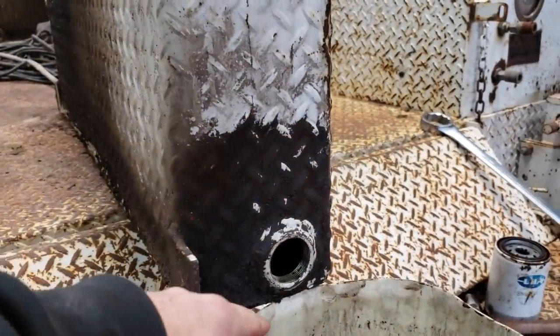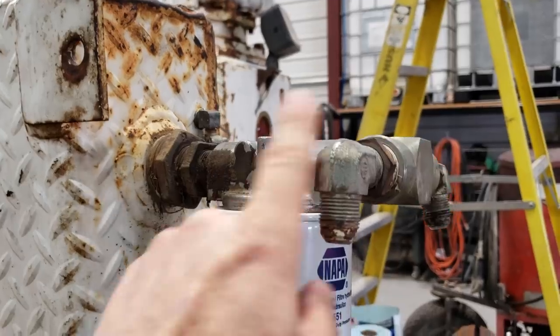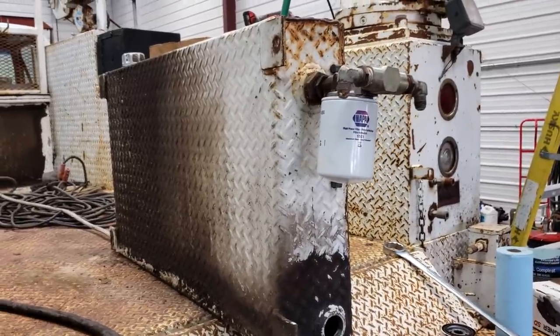This is our hydraulic tank, 1.5 pipe outlet, 1.5 return, but we're going to have to get a bigger filter and fittings for the return now with the dual pumps on it. So 3 days I should have the parts and we should be going back together.